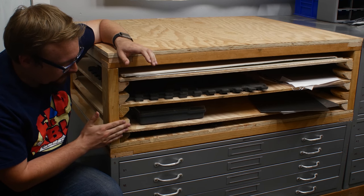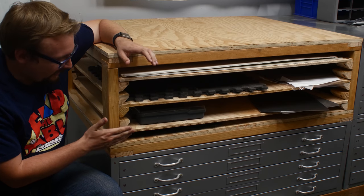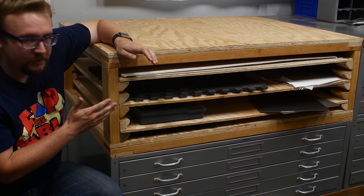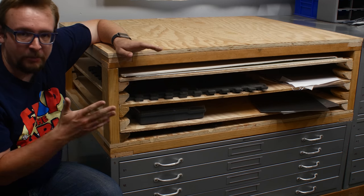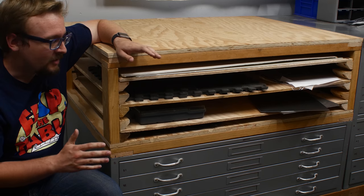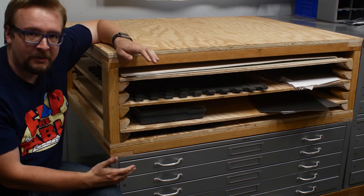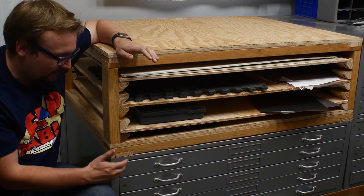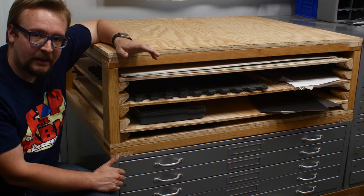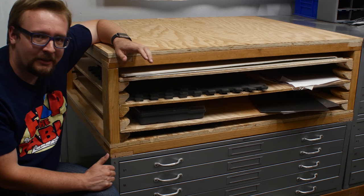The spots for the shelf rails should have probably been put on before assembling the rest — they were a huge pain to attach afterwards, and despite my best efforts things just didn't quite line up and joints aren't quite flush. That's partly from rushing and partly the quality of the lumber, which is fine but obviously not made for furniture. It works perfectly for my needs and is perfectly flush with the other cabinets. The slots I cut for the cabinet grooves worked really well — I was very happy with that. In the end I consider it a success, and more than that, a great learning process for new techniques, cutting wood, pre-planning, and more. Until next time!